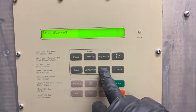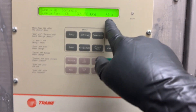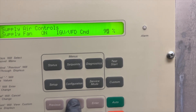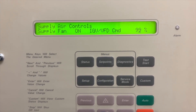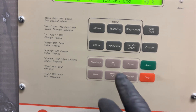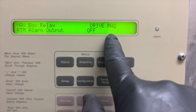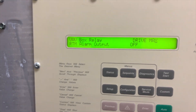Now we want to go into test mode, so we're going to hit service mode. This lets us test everything. We want our supply fan on, and I'll set it to 100% so I can see the maximum amp draw on the blower motor — you have to hit enter to confirm any parameter change. We set the VAV box relay to drive max so all the VAVs are open; if they're all closed at 100% you're going to have issues. The compressor relays we'll leave off because I want to control those separately to check amp draws.